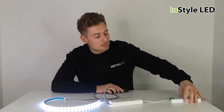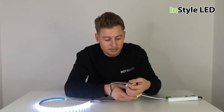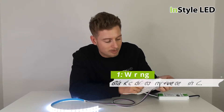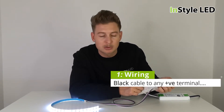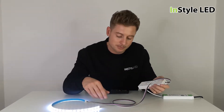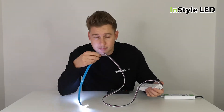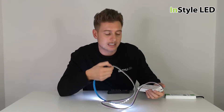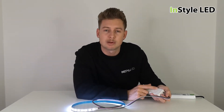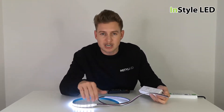First of all, if you have your power supply going to the receiver and to the LED strip, you must make sure that the black cable is in one of the pluses. You have R plus/minus, G plus/minus, B plus/minus, and W plus/minus. Out of your LED strip, if you have RGBW or RGB, black is always the plus. So black will go into any one of those pluses — we always say just put it into R plus.